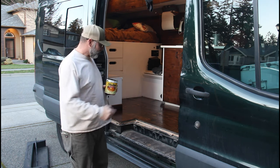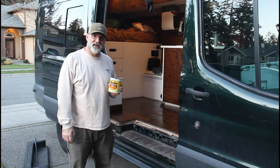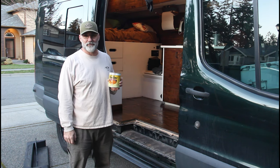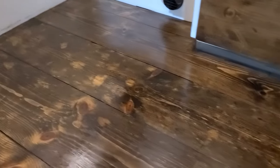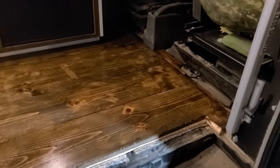I'm in the final stretches. I've already put two coats of shellac on the floor and I'm just waiting for this to dry. I'll put a third coat on, let that dry, and then buff it out. My challenge is I'm starting to lose light and it's getting a little cold — it's 48 degrees right now and this stuff doesn't work really well in colder temperatures. It is dark now, but fortunately the van has a heater so I've kept it nice and toasty. I've got three coats of shellac on there. I had to touch up a little right here, which is why it looks a little shinier — I haven't burnished it down yet. I'm super happy with how this came out. I'm going to put all the plastic and stuff back in, and when that dries up in another half hour, we'll burnish it out and it'll be ready to go.